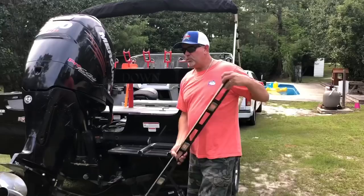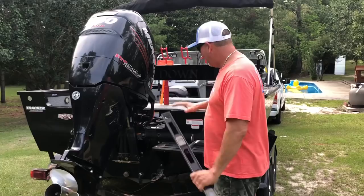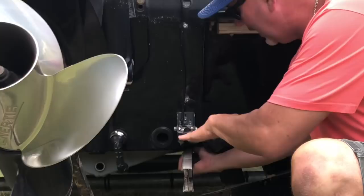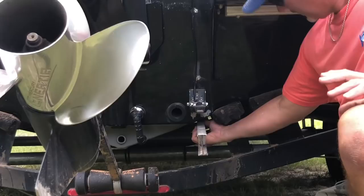When mounting the transducer, you want to make sure of a couple of things. I've got a four-foot level — I've experimented and learned a lot by trial and error. I take this four-foot level and lay it up on the bottom of the boat. I did not want my transducer exactly level or flush with the bottom, and I did not want it sitting below the bottom of the boat. It's probably about two inches off from being flush at the bottom of the boat. You just lay your level up there and you can get a good idea.